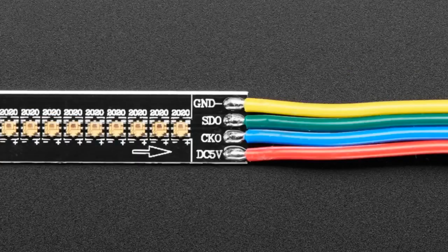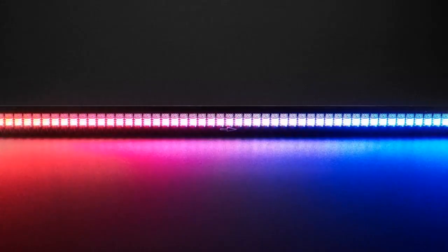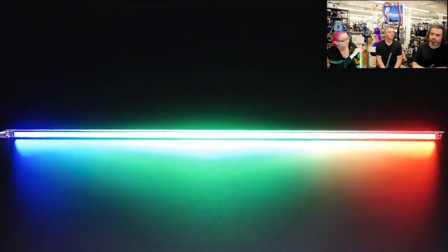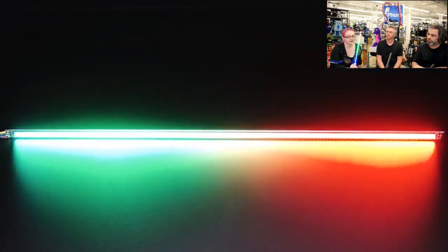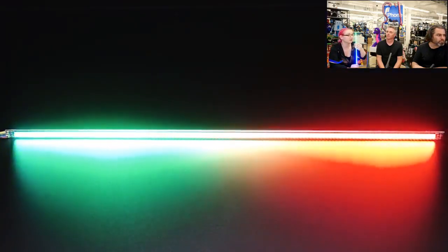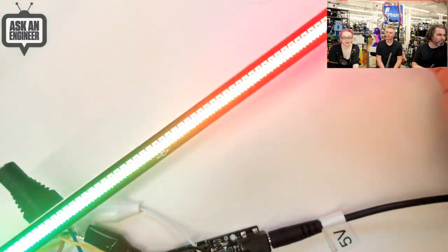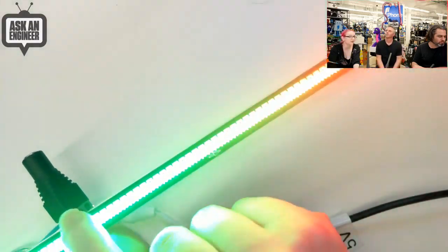The star of the show tonight — we wanted to get the ultimate high-density LED strip. This is 128 LEDs at 4-millimeter pitch. It's extremely high density — basically the LEDs are placed back to back, maybe even 3-millimeter pitch. It's bright. We requested the factory that makes LED strips to manufacture this for us. What's cool is it's on an aluminum-backed PCB, so the back is aluminum and acts as a heat sink — otherwise you actually can't drive this many LEDs. It's completely smooth color; unless you're really close, you can't see the dot separation, because they're 2-millimeter LEDs placed as close as possible.